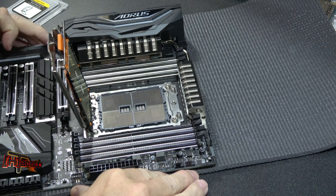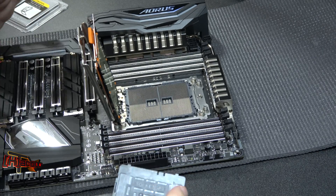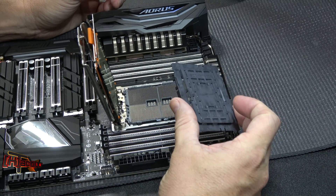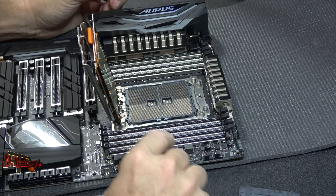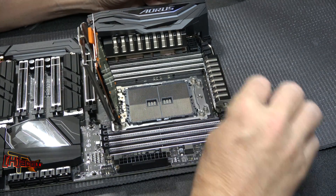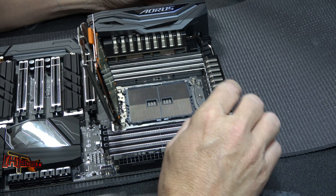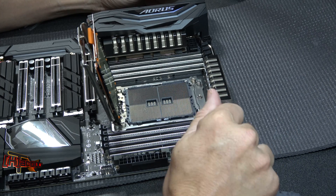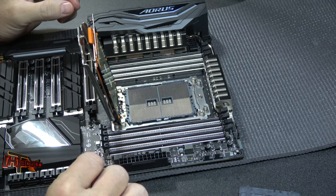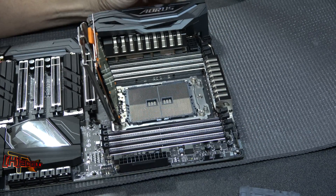Now I'm going to talk to you about these pins again, because these pins are extremely delicate. I have already destroyed this socket. I took this apart to give me a little practice here, make sure what I wanted to show you on camera — reinstalling this, I damaged the pins in this upper corner, and then trying to fix it, I ended up brushing my finger across the tips of some pins right down here and misaligned those as well. I do think I destroyed this socket. This will not be particular to Gigabyte, but even these pins compared to the Intel LGA sockets we've seen on board, these are tremendously, tremendously delicate. And I do not know if I'm going to be able to repair this. This perfectly illustrates why they've done this kind of mounting mechanism — they do not want you physically using your hands to lay that CPU down on there.